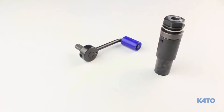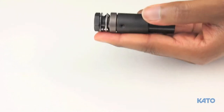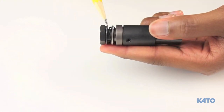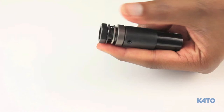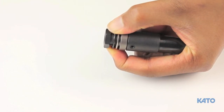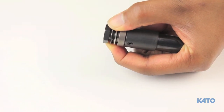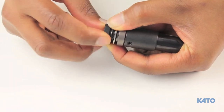This handle is included to manually adjust the torque during initial setup. To adjust the torque, you must release the lock nut from the dimpled washer. To do this, pull back on the washer so that the lock nut can freely turn. When you tighten the lock nut, you're increasing the torque. Loosening the lock nut, you're decreasing the torque.